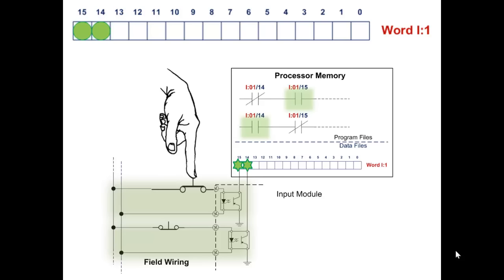So we can use normally closed push buttons, because normally closed push buttons fail safe. For instance, let's say that normally closed push button was a circuit stop or a motor stop. And if the wire became broken or the switch became defective and the circuit opened, then that declares that the button has been pushed, even though it really hasn't. So if it's a button that when you push it requests a safe state, then you want to use a normally closed push button, because if it opens, wire breaks, forklift backs into the machine, breaks the conductor, operator gets mad, bangs on the switch and breaks it, it fails, but it fails to the safe condition. So that is typically the conventional use of normally closed contacts, if you want a fail-safe condition.